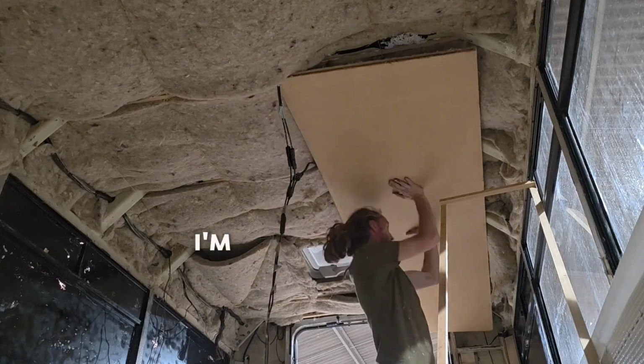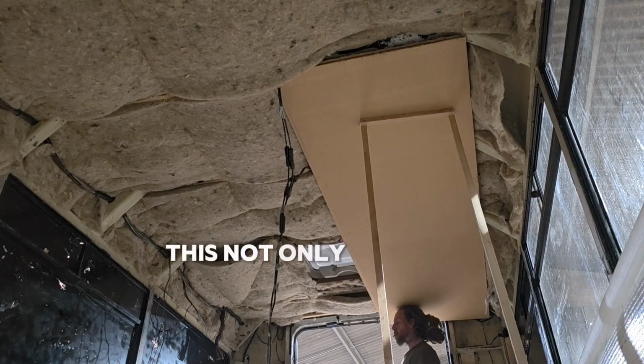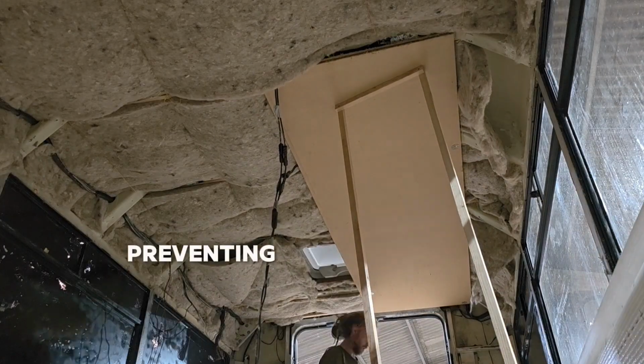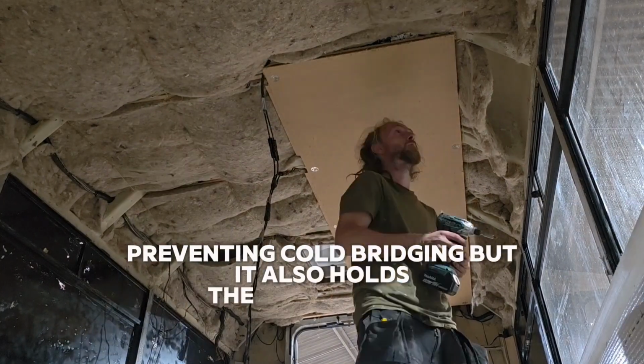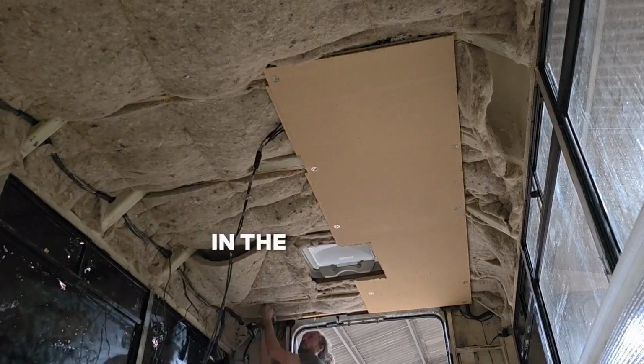For the ceiling, I'm adding an extra layer of wood fibre board insulation on the inside. This not only insulates the ribs between the wool, preventing cold bridging, but it also holds the wool in place and gives me a solid surface to fix the airtight membrane to in the next video.